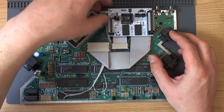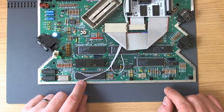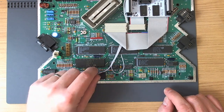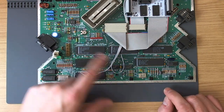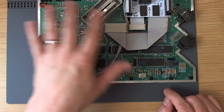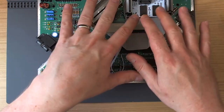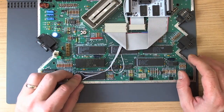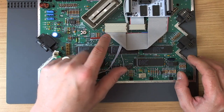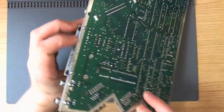I'm going to take the Ultimate One Megabyte off the board, so I'll quickly go over the hookup points I used. I took most signals — all but HALT — from FREDDIE here; it just seemed the easiest way to do it. I'm not aware of where the vias are for these signals on this board. I'd usually use vias up near the PBI connector, but there's no PBI connector on this machine, so there's not much chance of signals traveling up towards the back of the board. HALT comes straight from ANTIC.